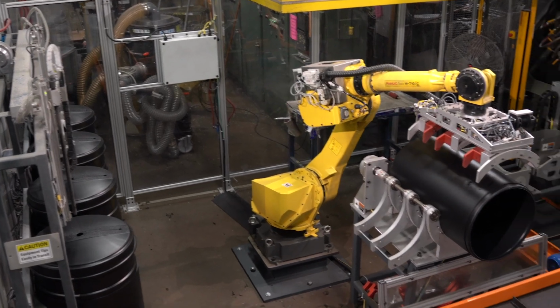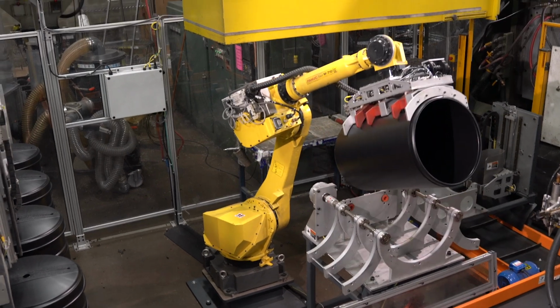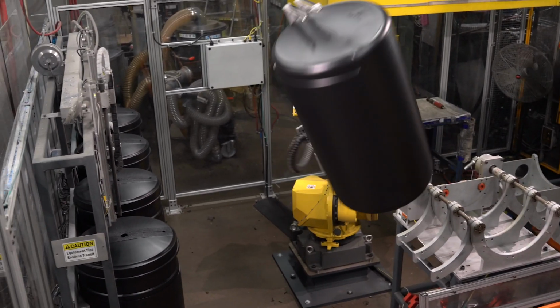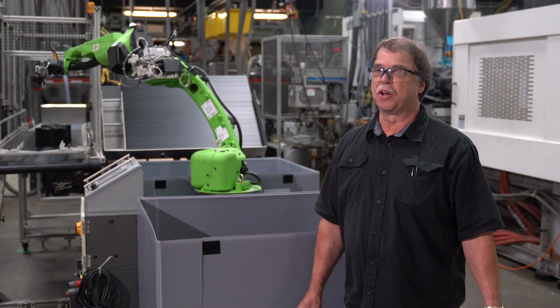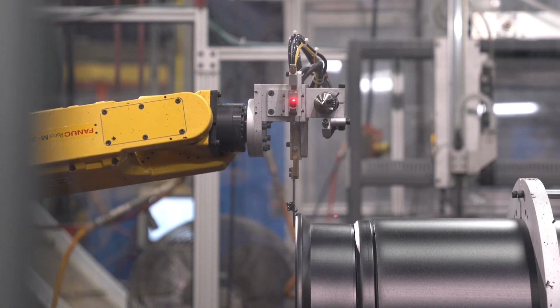Most of our trimming was done by hand. The operators would take the parts off, do the initial trimming, and put them in the boxes. In the blow molding application, when we went out looking for a better way to do the trimming, some of the things we wanted to eliminate was routing. Router chips, they scatter throughout the plant, and you go through a lot of material. We wanted to be able to use a hot knife or a way of trimming the parts.